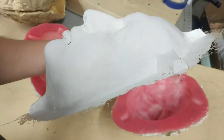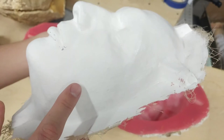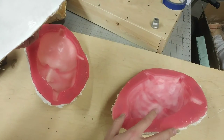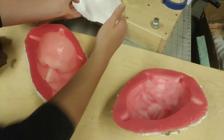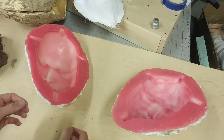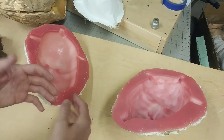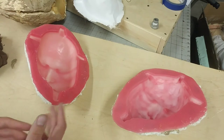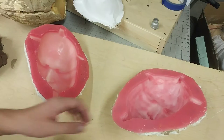I'm using my phone to film as always, but I can feel the texture of the skin. My brother took an alginate mold of one of the actor's faces and then duplicated it using his mold. Alginate is what they use when they take people's faces — they make a mask over the face with straws in your nose, cover your eyes, get your face covered in alginate, peel that off, and then pour hot wax or clay in there to create a mold. It's a lot of stuff, and as time progresses I'll put more footage together, but it's such a long process that it's hard for people to understand what's going into it.